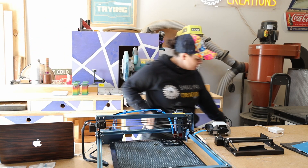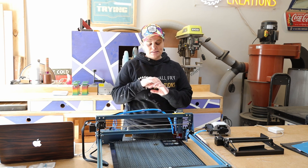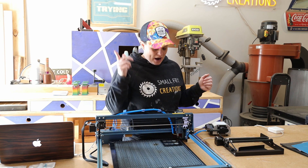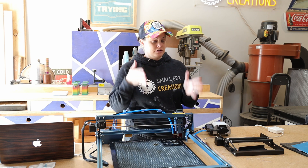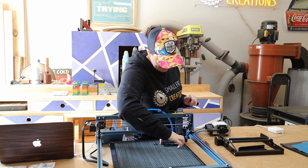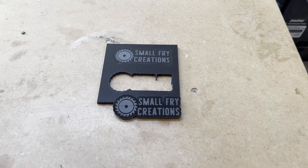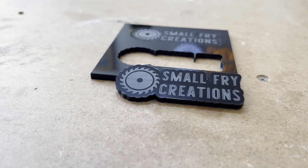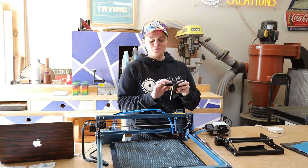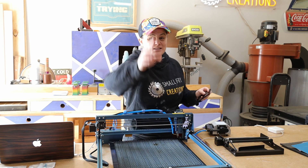The first attempt I did six passes on the cut at 70% and that ever so slightly did not cut all the way through, so I redid it and turned it up to eight passes. I think it's always better to go a little over what you think, because then you can guarantee that when you pick it up it is going to cut. Yes — it worked! And now that I've removed the plastic, the engraving also looks fantastic. That is really really cool on the black — you could do some cool things. Let's put this with our other test pieces and keep testing.